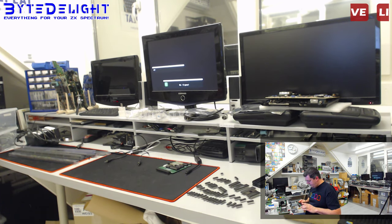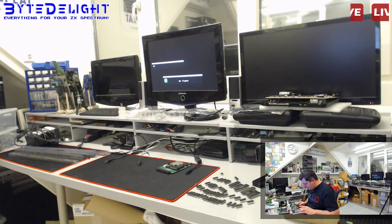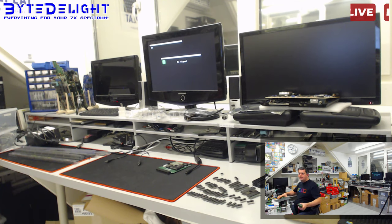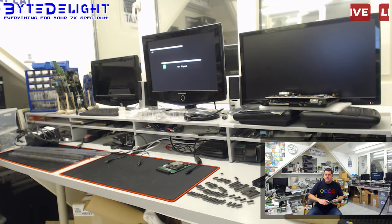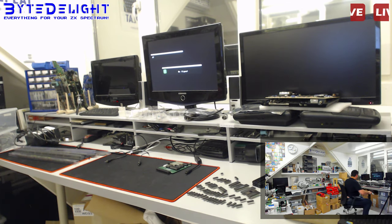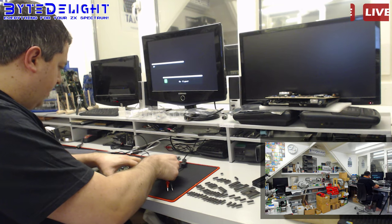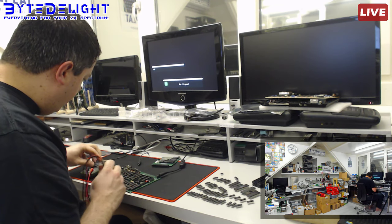Alright. Well, what could it be then? Sorry, of course, I just said that the card is not showing the 5 volt anyway, because we did cut the track, so we cannot measure it that way. We can only measure it by the multimeter at this moment. So, 5 volts.